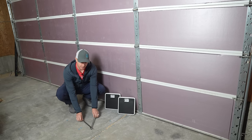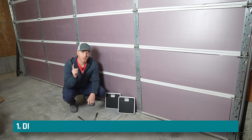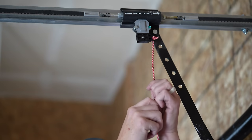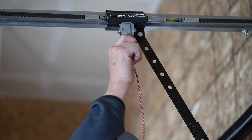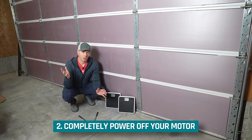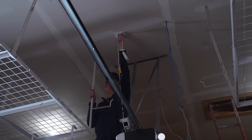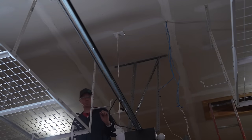Now for safety steps that apply for the rest of the process. First, disengage your garage door from the motor carriage — pull that little emergency pull string so the door is not attached to the motor assembly. Number two, shut off all power to your motor altogether. Make sure to just unplug it — don't try to disable it with a button, just pull the plug.